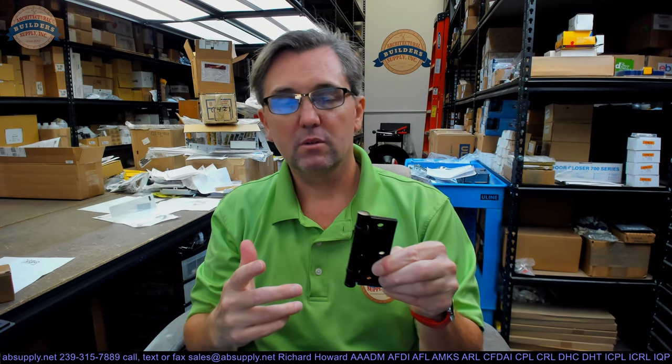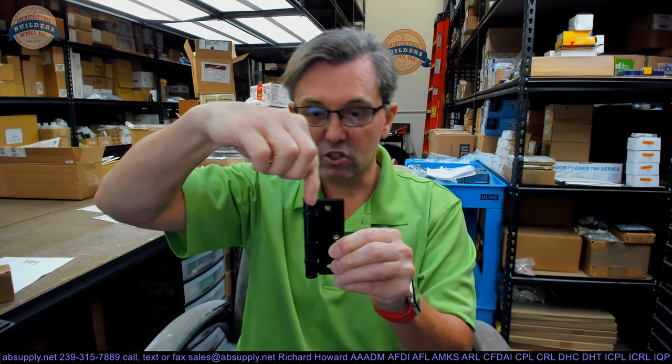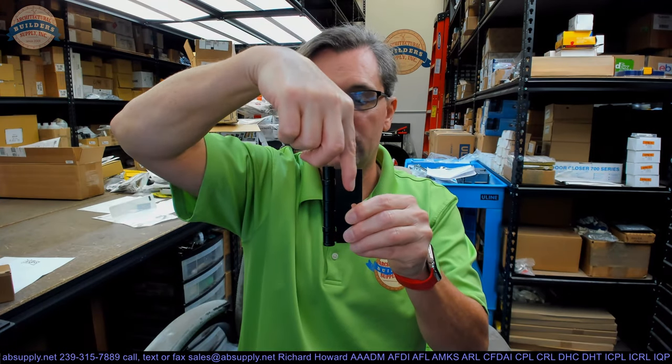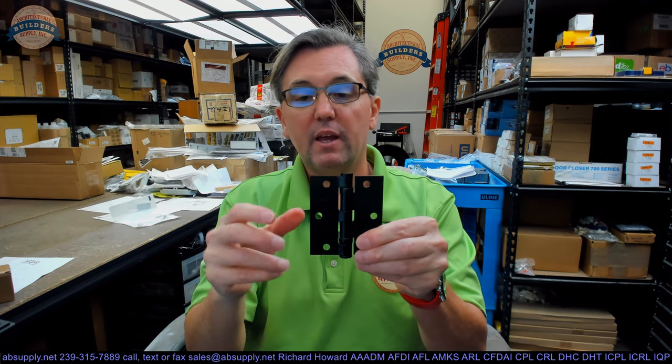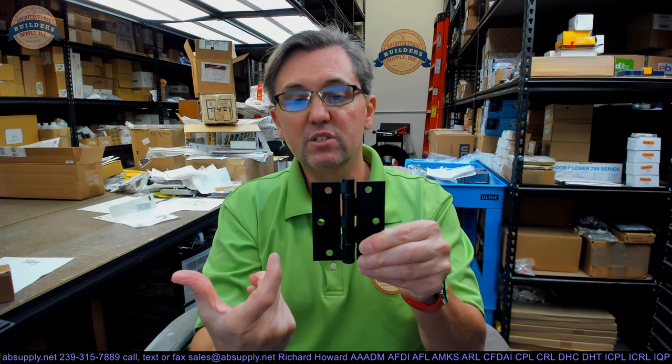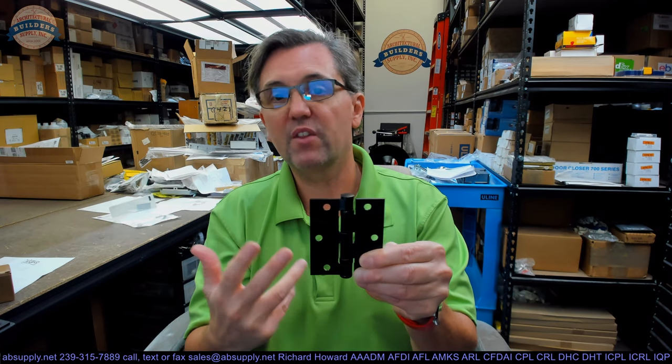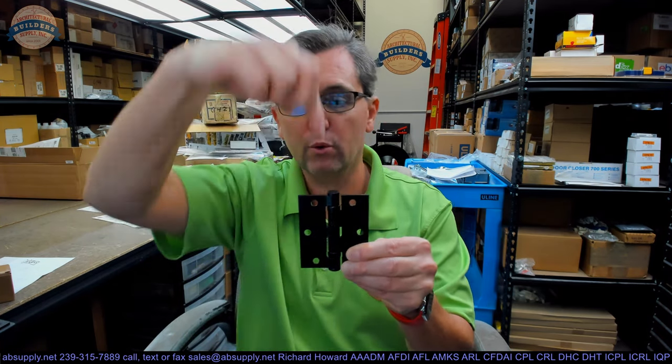The bottom line is this. Best practice would tell us to stick that vertical axis of pivoting as close to the face of the door as the application allows. As you move that vertical axis of pivoting closer to or further away from the door, you affect how the door rotates in comparison to a wall condition. Meaning, I want to swing the door out far enough to get around my very thick casing or my chair rail or my base or some sort of reason that I need that vertical axis of pivoting in a particular location.